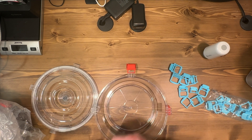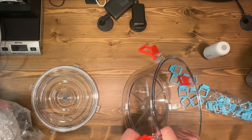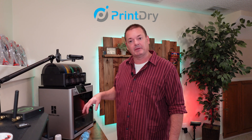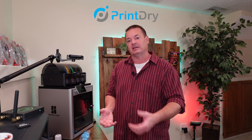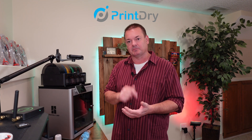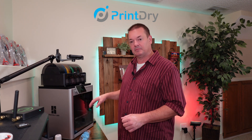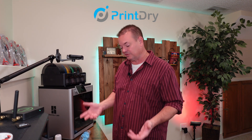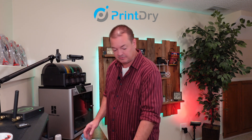If you're new like me and have no idea how to print ABS, I'll give you one trick I've learned with my Bambu printer: print one at a time. I can fit a whole bunch on my plate and the printer can go layer by layer and build them up. But what happens is the ABS just starts shrinking and curling, lifting off the plate. If the printer is constantly printing to that clip, it stays flat. So print by piece — I can get four on my plate, print one at a time, and when it's done I've got four perfect clips.